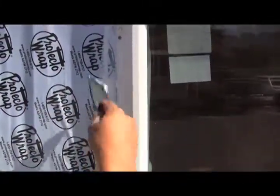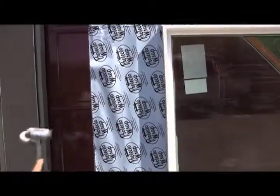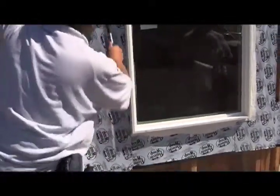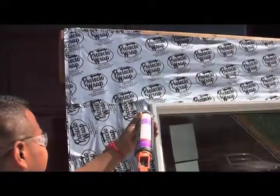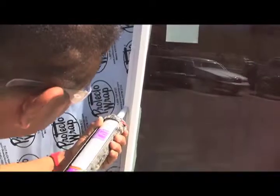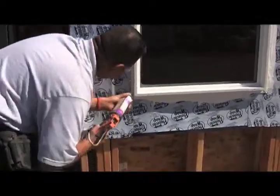We received a lot of phone calls from people who want to apply a waterproof membrane on top of their nail fin. If this is the way that you would like to flash your windows, this is how we would do it: tool off your excess sealant, cover your screws with it, then apply your peel-and-stick membrane on top of the nail fin, j-roller it nice and flat, and then at the edge of your nail fin against the window apply a bead of sealant — just in case you have wrinkles — to stop any water from getting in behind your waterproof membrane. It's worth noting that if this is the way you want to flash your windows, you should apply the side flashing before the top flashing is applied.